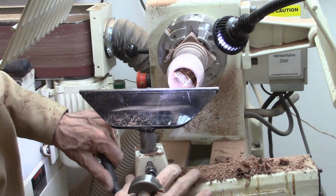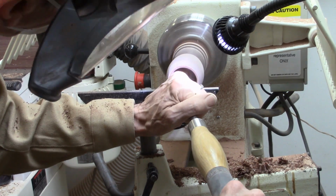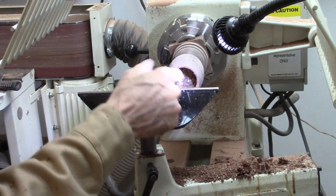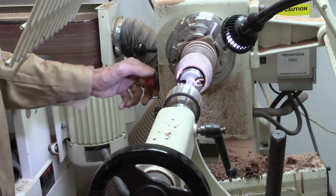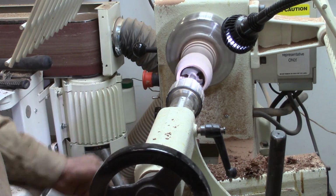Then back out the drill bit and using a carbide tip chisel, shape the interior surface to near its final dimension. This is done in order to minimize stress on the many glued surfaces of the inserts. Repeat this process of drilling down into the block in 1/2 inch increments, followed by cleaning up of the interior surfaces until near done.